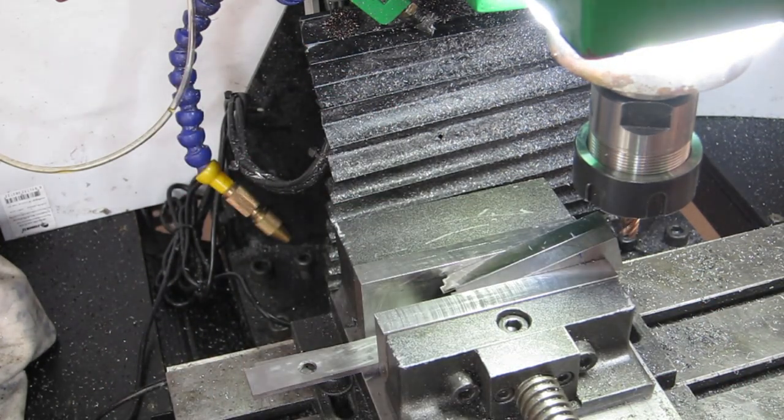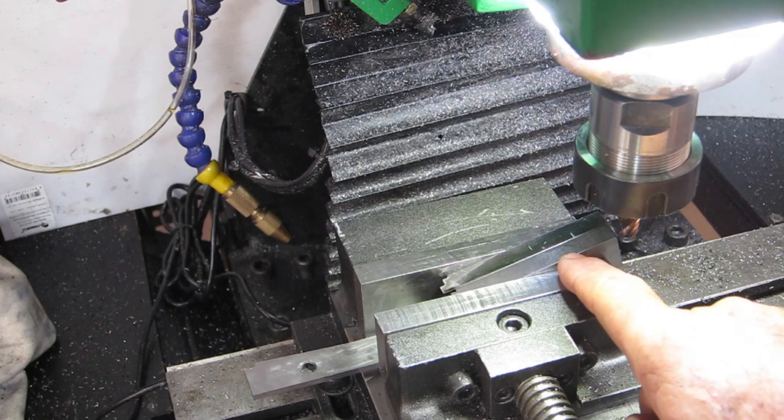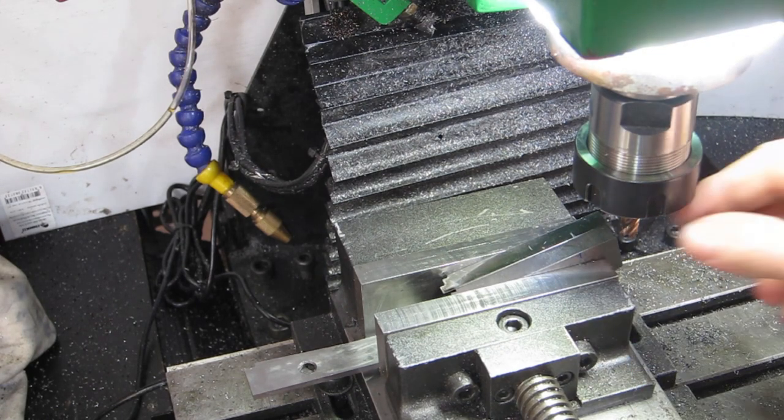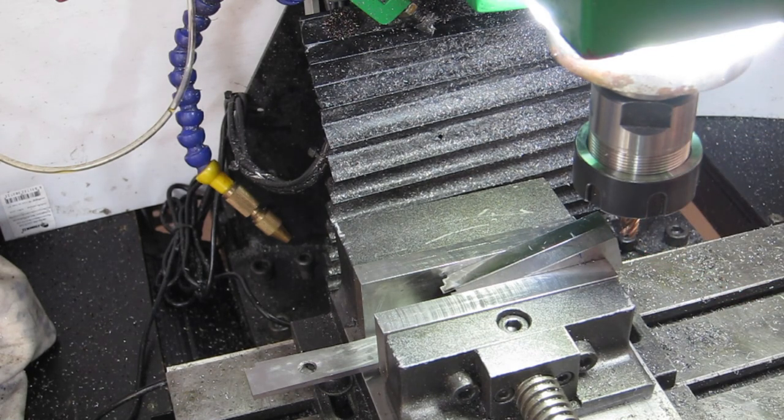I don't really have any precision gauges or anything to use for that. So I'm just going to mill this down a bit, down this little blue line here, and see how we go. Run out of tools, this little 8mm roughing mill's about the only decent cutter I've got at the moment. So we'll get into it with that. I've got some on order, but this water throwing madness that is Songkran is still raging here.